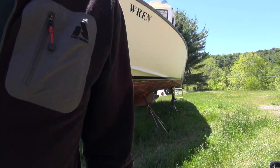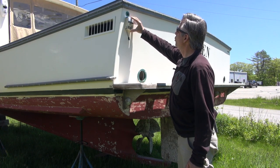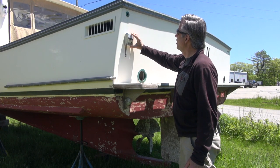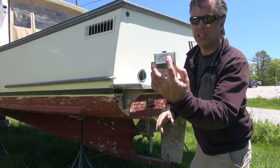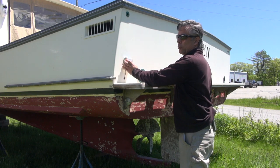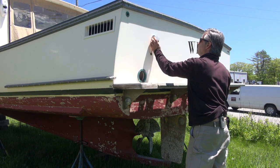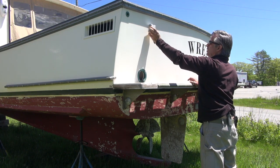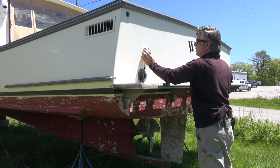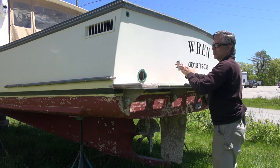Let's check the back of the boat. Okay, that shows moist right there. Not wet, but moist, in the middle of the yellow. Could be a fuel hose or a fuel tank behind there. We should look at that. Dry, moist. Just at the beginning of moist, so that's about 2%.